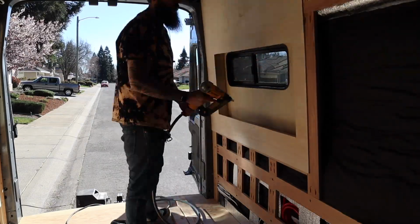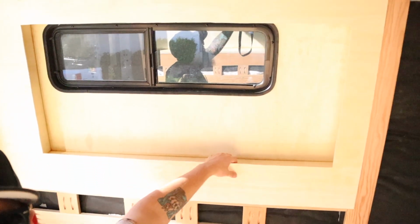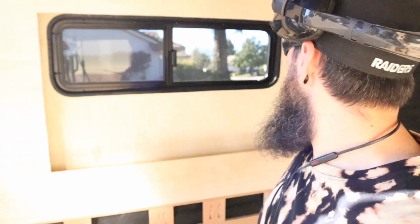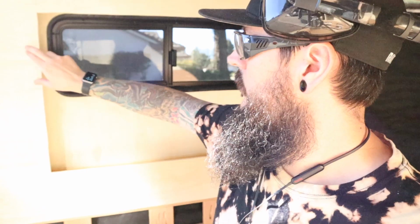One piece in place. Now all I have to do is router around these edges inside the box here, and it should look real nice. I've got my router here. It's my first time using it, aside from about a 5-minute tutorial last night, so wish me luck. I've got a 1/4 inch flush trim bit, I think it's called. It should let me go right along the inside of my box and trim off all this excess, and then we should have a nice solid frame all the way around. Then I'll throw in a few more brad nails along the edges.